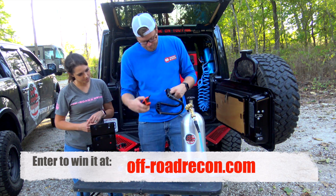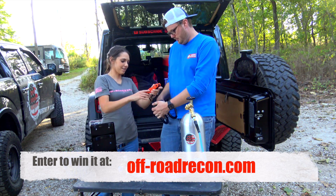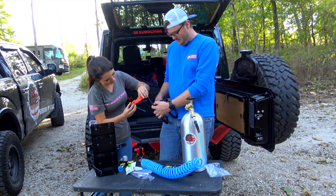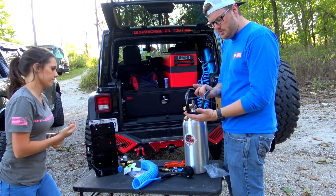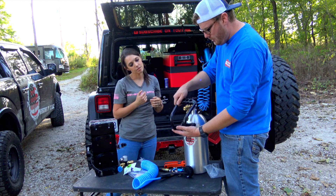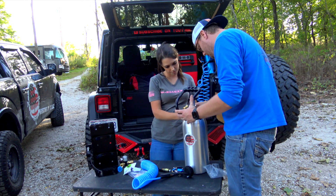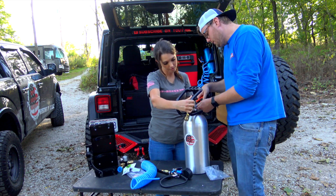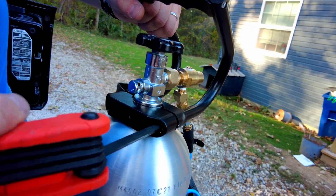Now let's put our handle on — just a big Allen wrench. What we've done with this handle is put it where the regulator comes out of your handle, so that the regulator is protected by these two metal ribs that stick out. You want to work these in evenly — screw one side, then the other, so your handle pulls together tight and even.